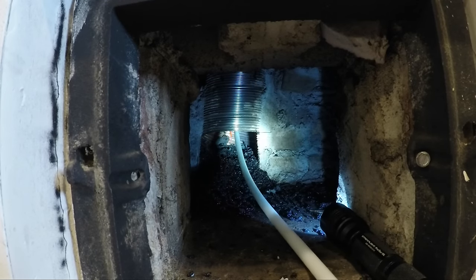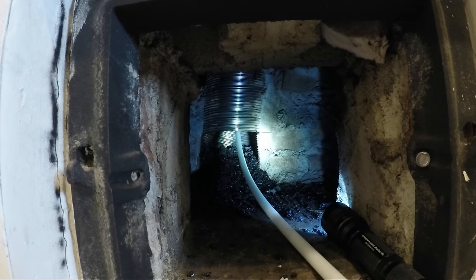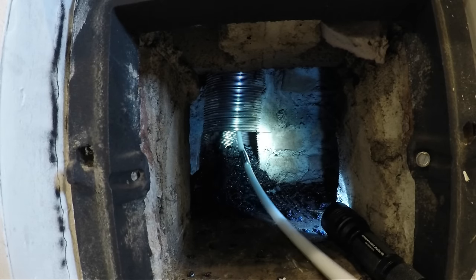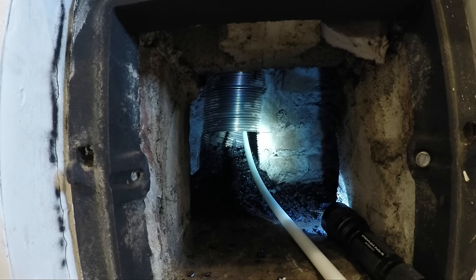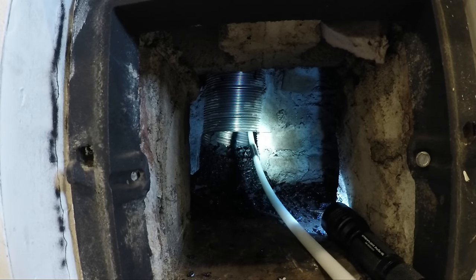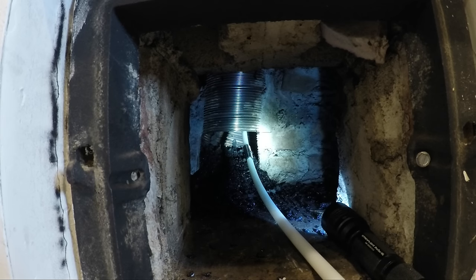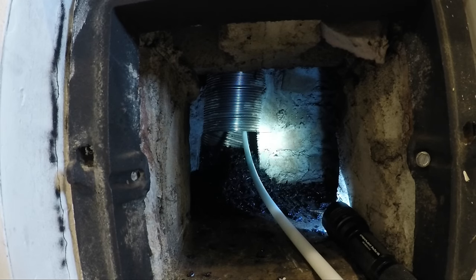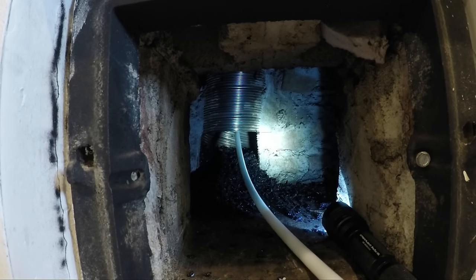Feels like it's going. Okay, one. Got one in there. Slip in a second one. Oh wow, okay, now we're moving. Now, we'll see if I have any issues removing this thing after the fact. Okay, now we're still. What I'm going to do is I'm going to put them all in until this stops, and I'm going to clean from the top down. Oh. Well, alright then. Got things falling out. I think I'm at least to the first floor because I know that the chimney is really nasty up where the wood stove is.